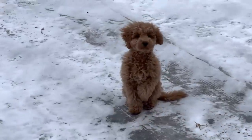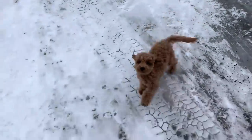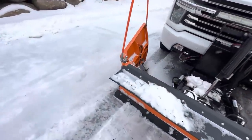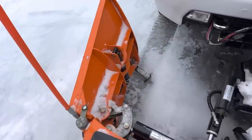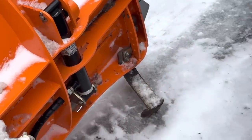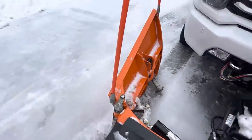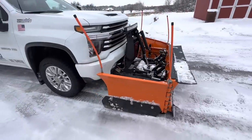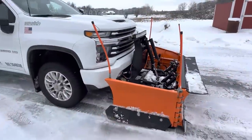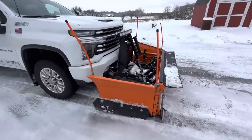Shooter, what do you think of this F12 front plow? He likes it. Anyway, there's a lot to it. You can see my one foot — I had a marginal pin to hold the foot up and it popped out, so my foot came down and I got bent. Just straightened that out. But I've used this for about a year now, got a season on it. The only problem I've had was that one cylinder quit working. Put a new one on and it was good.